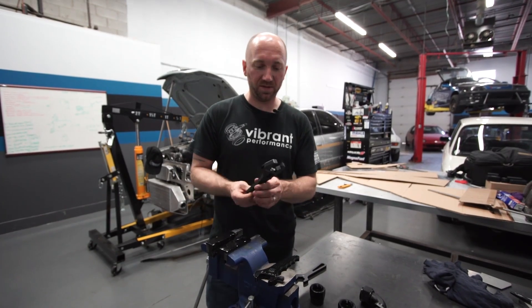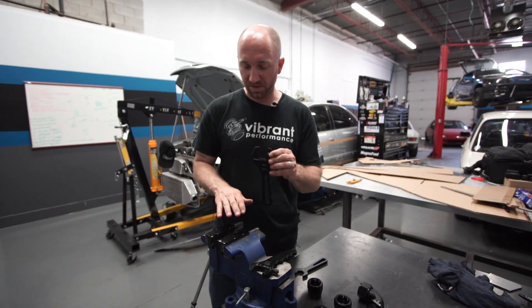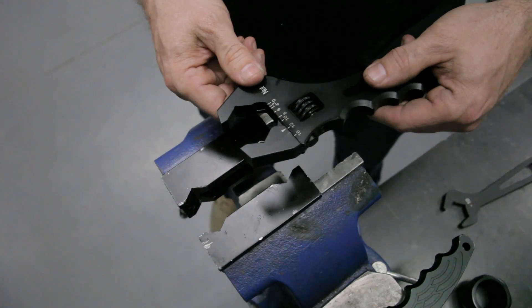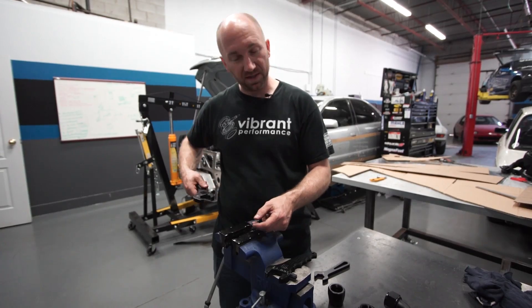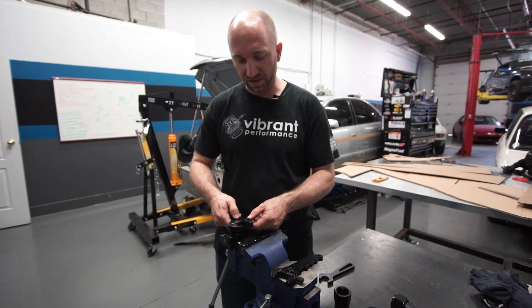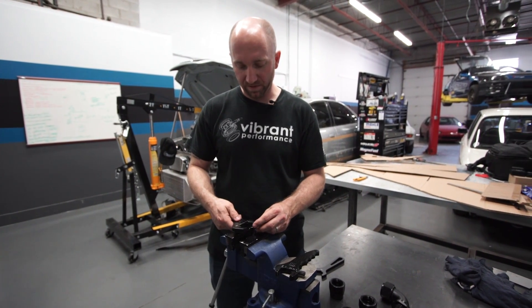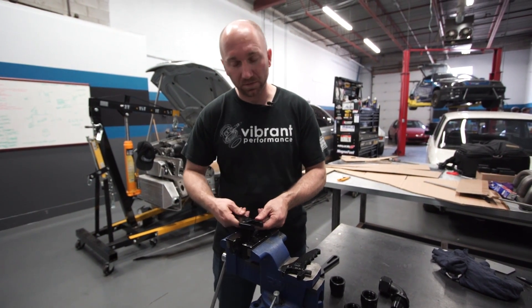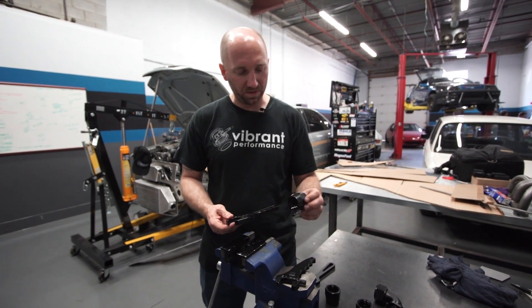What's nice about this V-jaw wrench is that it acts just the same as our vise jaws. It engages the nut on four sides, so it has a nice positive feel when you're tightening — it's not going to allow it to twist and it's not going to slide off your nut. The only way to get it off is to actually open it up or slide it straight off. That'll give you a nice positive feel when putting your hose ends together, and you're not going to mark up your hose nuts.